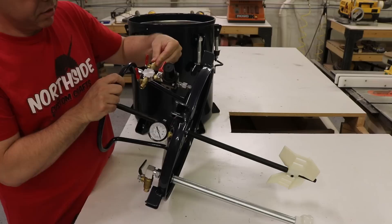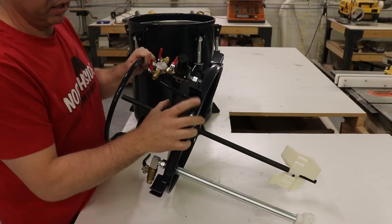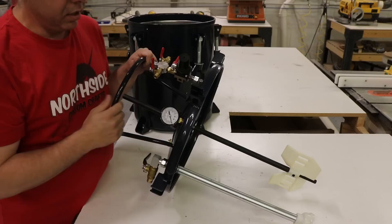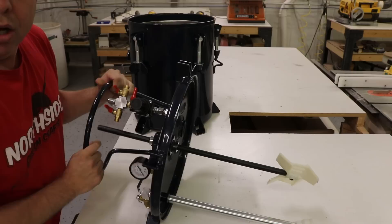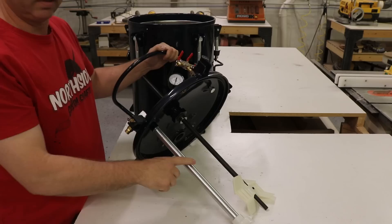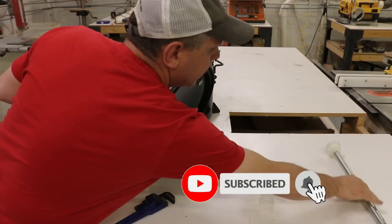Here's your regulator — air goes in here and you regulate the air pressure. Here's your pressure gauge and that shows the pressure in the tank. What we're going to do is: anywhere there's a place that air can get out, we want to plug it. We want to make sure air can't get out but it can get in. We want to be able to regulate it and we still want our pressure gauge. The first thing we need to do is get rid of this pipe and this rod, so that's where the pipe wrench is going to come in handy.